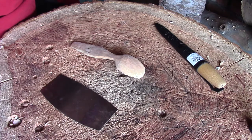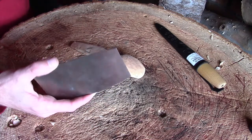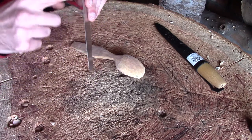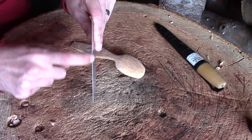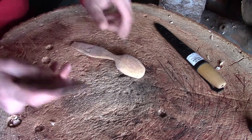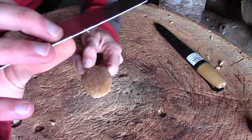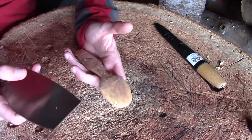Let's start off with the basics of scrapers. Essentially, as the name suggests, it's generally a piece of fairly thin steel with a flat spine — like you would get on the back of a knife — that's been done to a sharp 90-degree angle. What it allows you to do is scrape your piece of wood, taking away really, really thin shavings. It's designed for finishing and smoothing down.